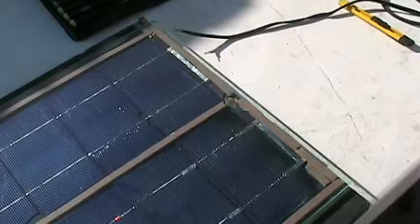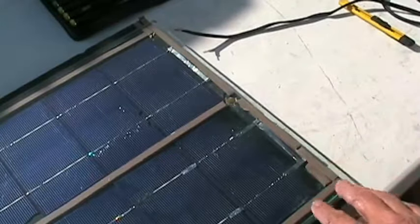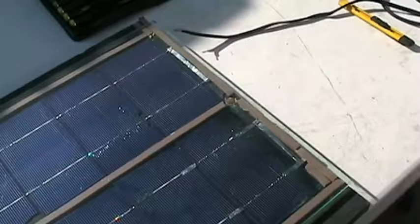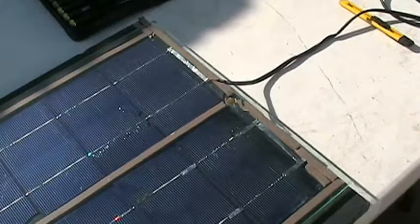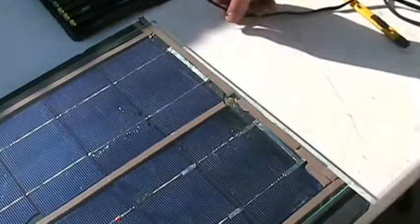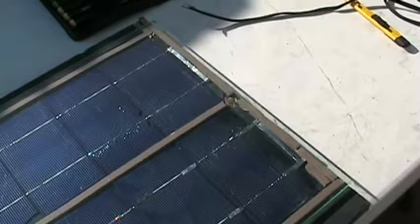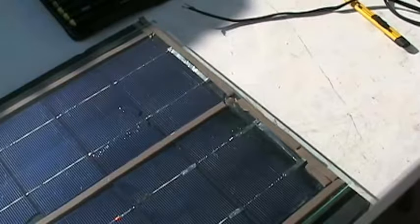I realized I don't really need the blocking diode for this solar panel because I have a charge controller, which takes care of not letting the battery drain back into the solar panel at night. So I went ahead and just made the connection — soldered it. There's the negative; the positive I still haven't soldered yet, but it's touching. I used it yesterday to charge a little bit to make sure it was working, and it did add some amps to the current. This is make it up as you go — no blueprints, no plans. It all started with this piece of wood and I got lucky with the glass and the weatherstripping. I managed not to break all the cells, so I had enough to do 18 volts.